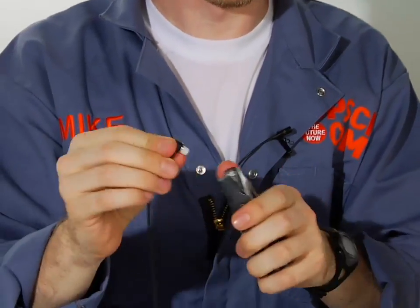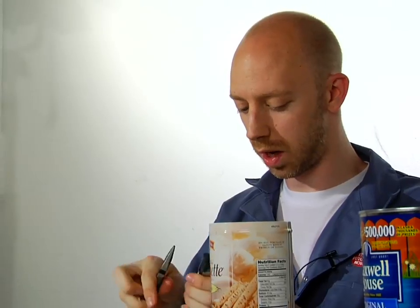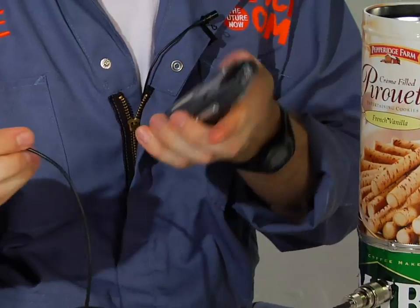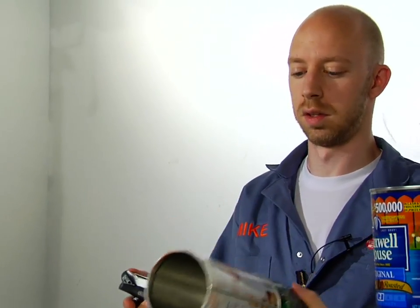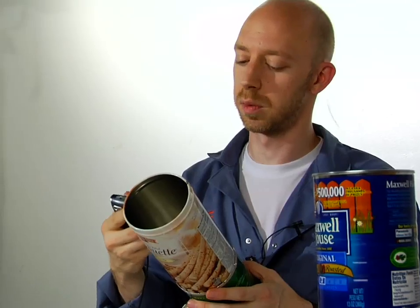You're probably thinking, well, where am I going to plug this into my phone? Well, every phone actually has on the back of it a little rubber port like this. If you've never ripped it off and seen what's behind it, what's behind it is actually a place to plug in an external antenna — it's as though the cell phone companies anticipated that reception would suck and someday we'd have to do this. So there's a little hole back there; it fits perfectly if you bought the right one. Plugs right in. Now all you've got to do is take this thing, hold it outside your window. Go to WirelessAdvisor.com — it's going to show you a map of where the closest 1900 megahertz tower is, because that's the signal we're capturing with this thing.